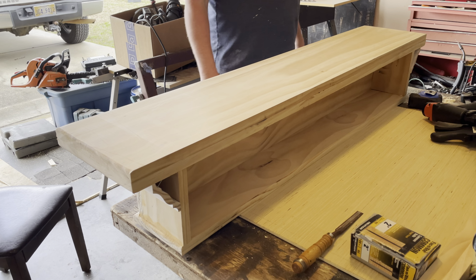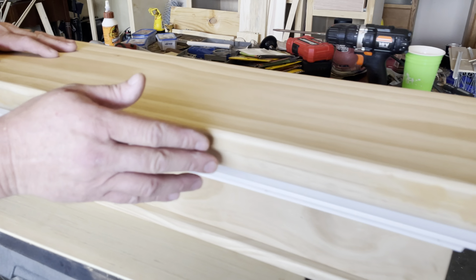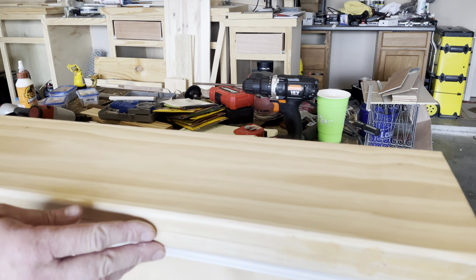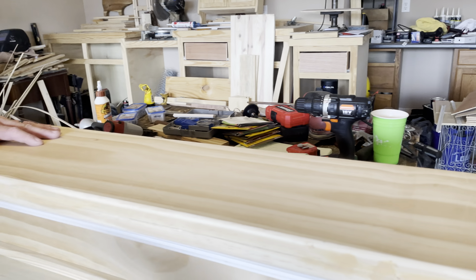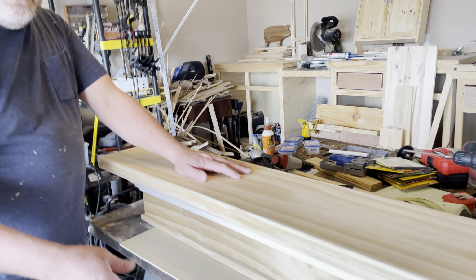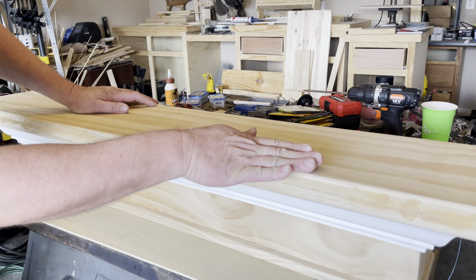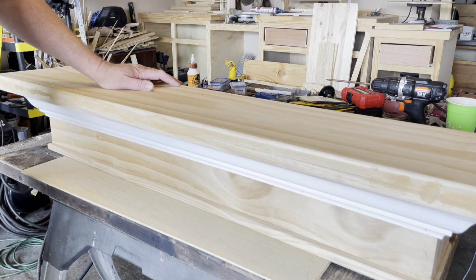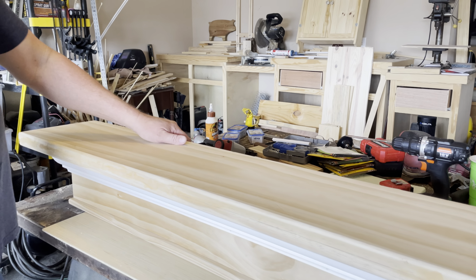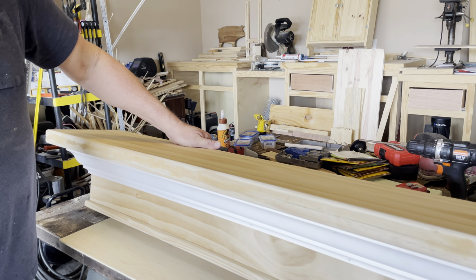Okay. And so you still have to sand. I see you put some wood filler in here. Yep, I don't want to see a seam between the two pieces. That's the only reason for the wood filler; you're never going to get a perfect edge. Thank you. I just needed that in my QA department. I also used a quarter inch router bit to soften the corners just a little bit. Again, that's what the picture they had sent showed. This is the way it turns out.